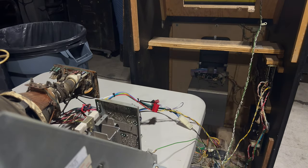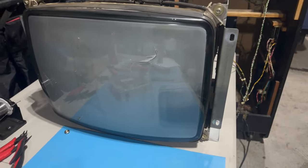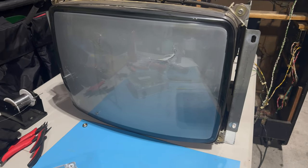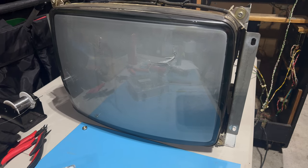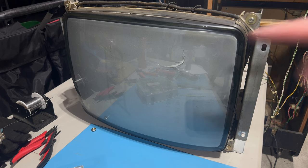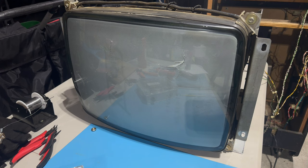And I'm hoping, if I did it right, if we come back over here and power this on, we should get Atari Kangaroo on this monitor. And what's funny is, the US manufactured upright version of the Kangaroo actually had a second video connector designed for this monitor, because Atari was using this Matsushita monitor in things like Millipede and other cabinets. But the Irish harness doesn't have that alternate connector for an alternate monitor.